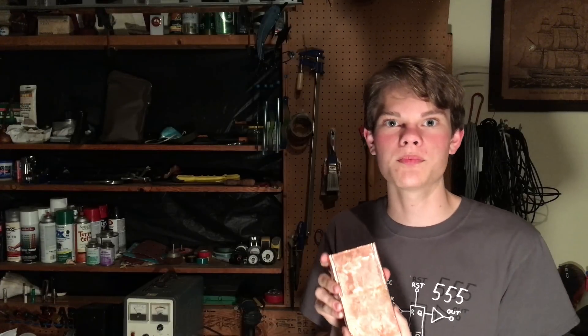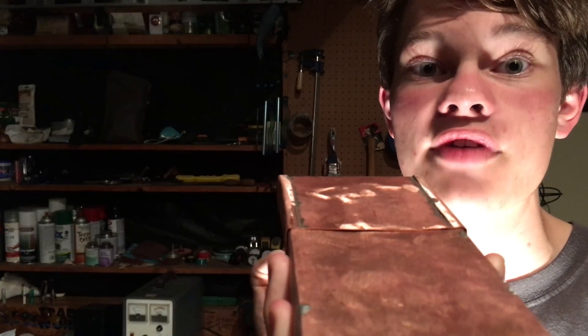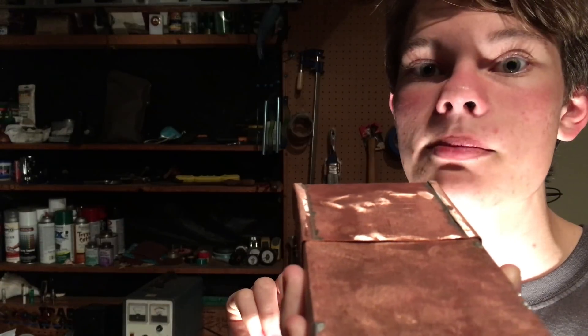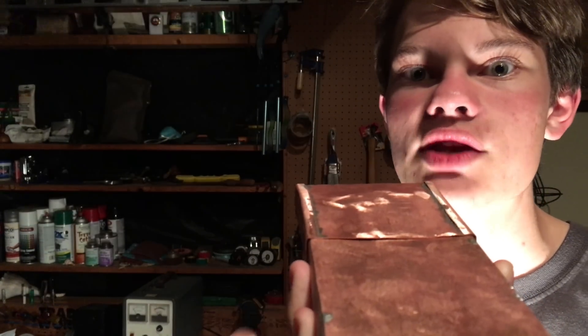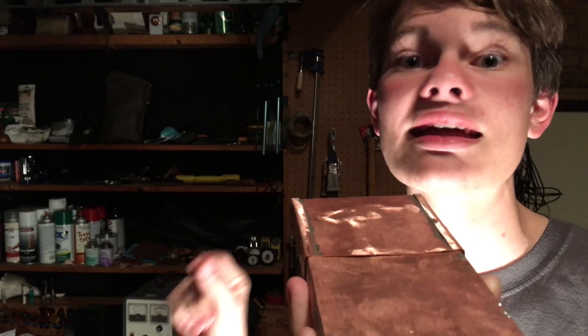Congratulations on making the Faraday cage! To check the effectiveness of your Faraday cage, there are a couple of things you can do. First, call your phone when it's outside of the cage, then call your phone when it's inside the cage — you shouldn't be able to call your phone. If you can, make sure that the gap between the top and the bottom of the case is very small, less than a millimeter. If the screen is on and you can see the brightness through the case, it's not tight enough.